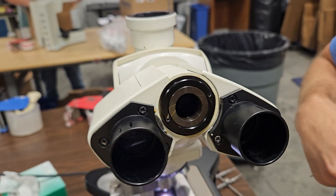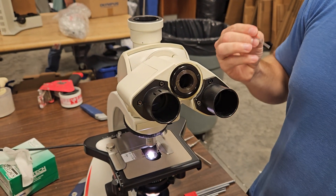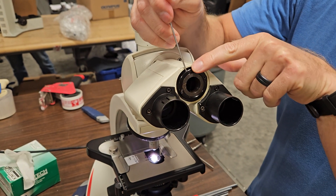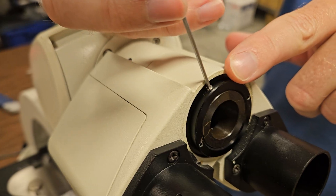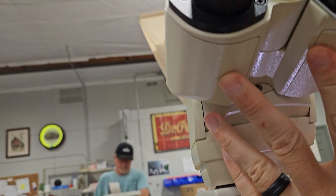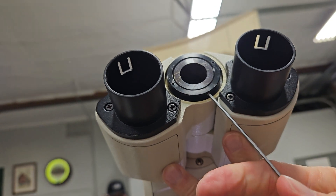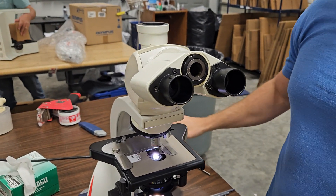Now that the cap's off, you'll notice there's two span holes right here. See how it's fallen on its own? Then you're going to take a 1.5 millimeter Allen wrench and locate the locking screw right here at the top. You're going to back that off, and then go here to the bottom — there's another one right here. You're going to back that one off slightly.